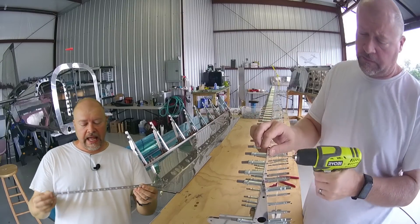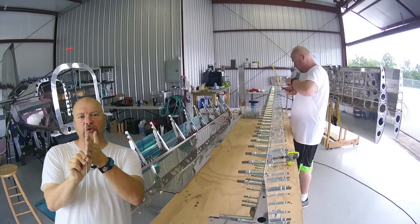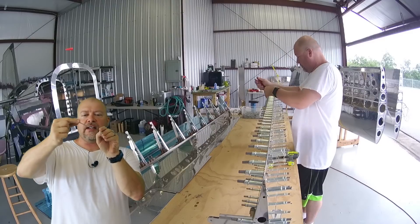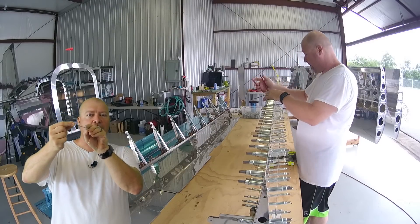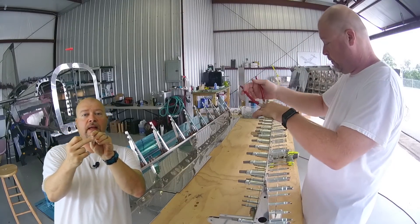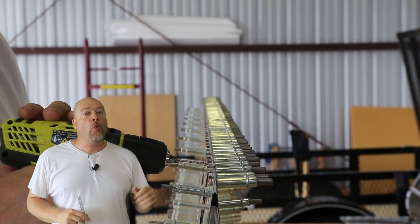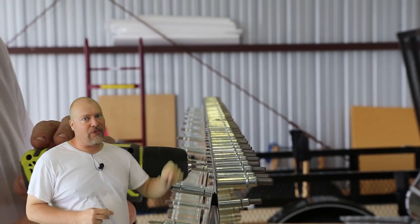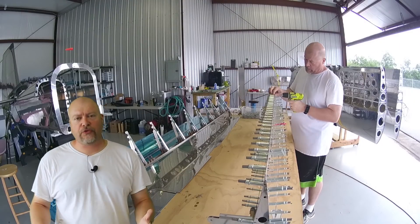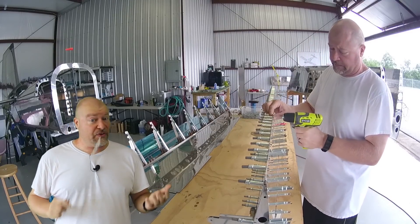What's important is how you drill that trailing edge. You've got this piece that comes to a point on one end and is wide on the other — this is what goes between the two skins. If you're drilling from the skin, it would be easy to drill at an incorrect angle. The problem is you're going to drill through the other skin incorrectly. You have to make sure you drill perpendicular to the center line of this part — that's important. Otherwise, you're going to screw this up. You don't want to drill it like this; you want to drill it like that. That's the correct way. When drilling your trailing edges, keep them straight, keep them clean, and make sure you don't mess up the opposite skin. If you're not careful, you will.